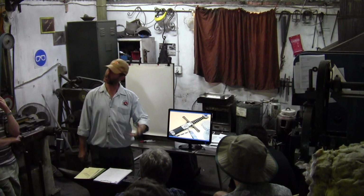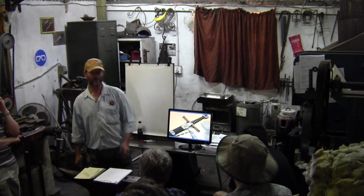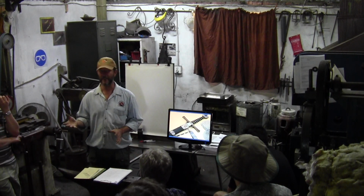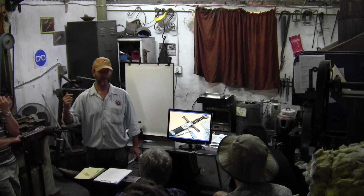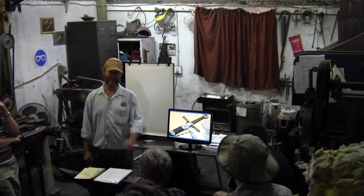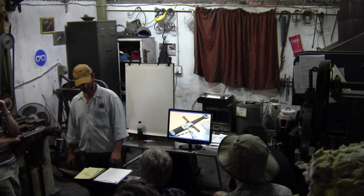If you're going to make a wood chopper, it's going to be made differently to a fighter. The fighter is going to be light and quick. It's got a dagger point. The wilderness knife is balanced entirely differently. It's heavier to the front. It's more blade heavy. The fighter needs to be tip light, not tip heavy. So you've decided on the function first.